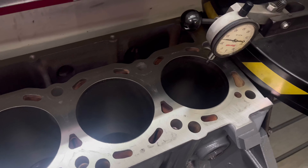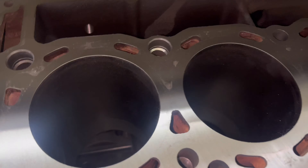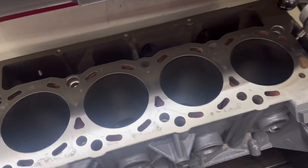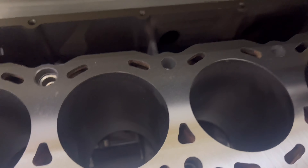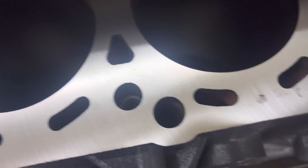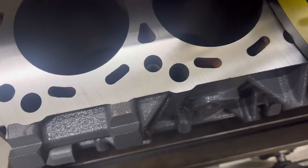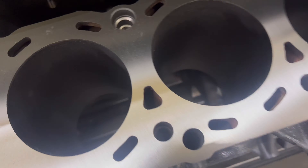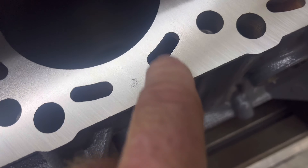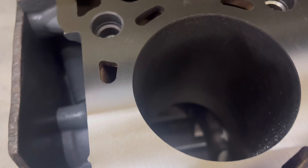Good level, good level. Let's go down and clean it up — that's two thousandths. So it's probably going to be about four by the time it's done. We'll do one more on it just to get it clean because we have plenty of room. We'll do a zero pass on it. We still got a couple of little lines but nothing extreme — it looks pretty good, we're going with it.